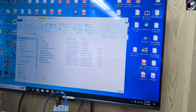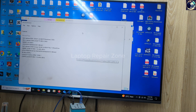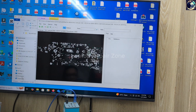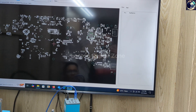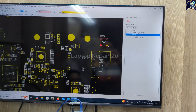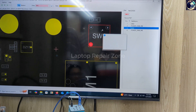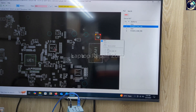I need to open the board view to find out where the switching voltage comes from. This is the exact same model and we have a power switch here — as you can see, pin 1 and pin 3 are ground, and pin 2 and pin 4 are switching.